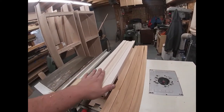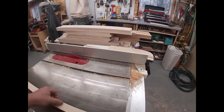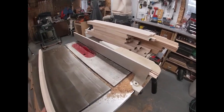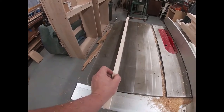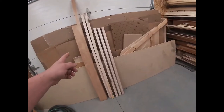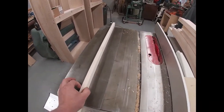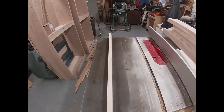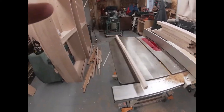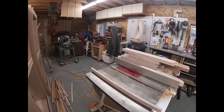but I'm going to be changing the planer thickness to plane these down, so I have to be very accurate when I get close to the measurement. The new boards I hold flush on the cast iron and make sure it's perfectly flush. The reason I have to have it exact is when these are actually in the unit, if I have this one exactly 3/4 of an inch, but I have those mixed in and they happen to be a 32nd over or 32nd under, it won't pinch them and sandwich them correctly. So there'll be some that won't hold up on their own or some that'll just fall down on their own. But yep, I'm gonna go back and plane all those down and see what I can get.